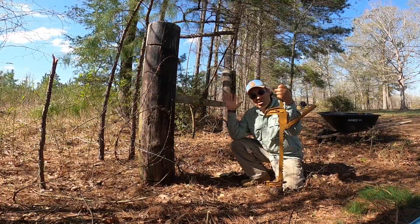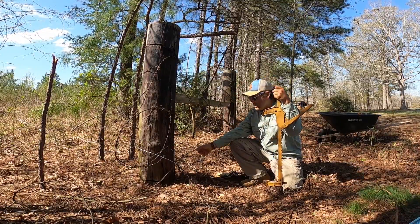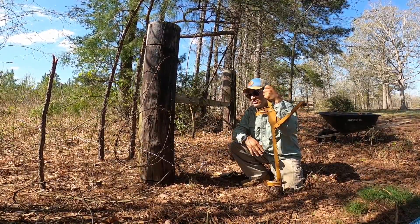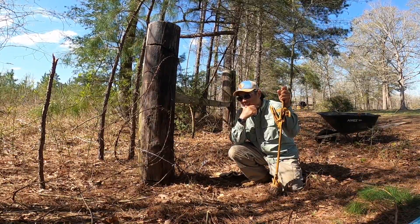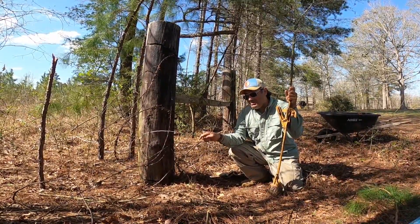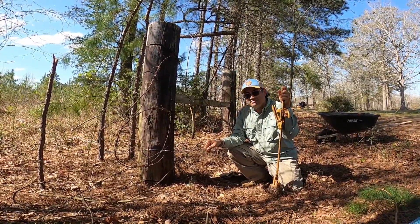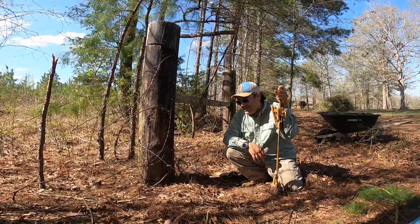I stretched out all five strands of barbed wire from the right side to this fence post. I wasn't able to utilize the fence lines themselves because there's not enough slack and nothing to bind on — you need something sturdy. That's why I used this barbed wire loop; it just clips on and works great. This tool is traditionally used so you can bind on one end and the other and bring it together to fix a broken line, but there's nowhere to put tension to it here, so I had to use this loop method. If anybody knows a better way, please let me know — I've used rope in the past and it snapped, I've used straps and they snapped. This works really well. I just use a little portion of it, cut off the knot after, and it works great.